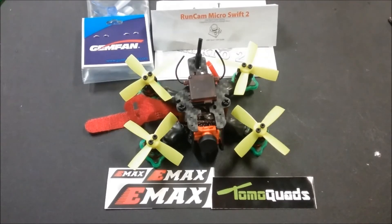For props, I'm going to first test the Furious FPV 2035 and then I have the GemFan 2035 four-blade as well — you can use any of the 2035 props. For lipos, I had some Storm 4S 350mAh packs, which is under what I recommend. I really feel you need to be at 450 to 600mAh 4S to get your flight time in the 3-minute 20-second range. Tattu, Glacier, and Ready-Made RC all make great packs with the XT30 connector. I tested the smaller packs — they're super light — but I was only getting a little over two minutes flight time, so it's not worth the shortened flight time.